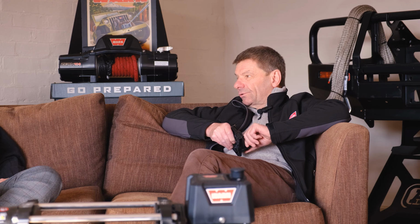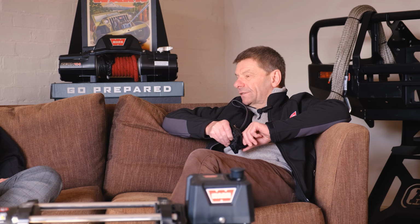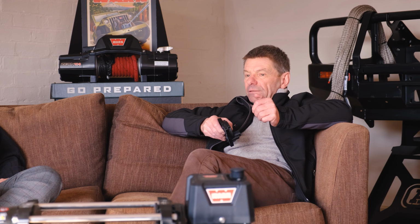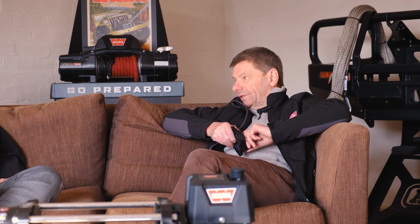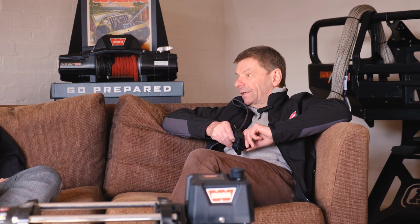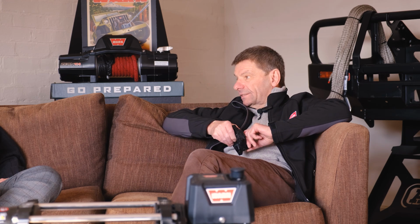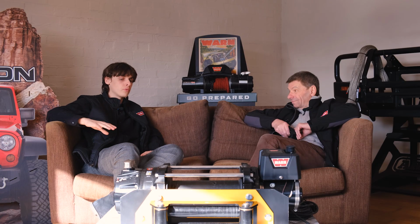What makes the OLI so important, and what happens when it reaches its pre-programmed limit? What we need to remember is that the standard itself has safety at its core. So the ENstandard, it's a standard of excellence, but it's actually about safe operation and safe use. So the purpose for the OLI is to make sure that the operator can work within a safe parameter in terms of the actual operation of the winch. So he can't accidentally be focusing on the load that he's trying to pull and not realize that the winch is actually being overloaded. So if he does get to that position, then this actually cuts the winch out as a safety factor. Apart from the OLI, what other features contribute to the winch's safety and the ENstandard?